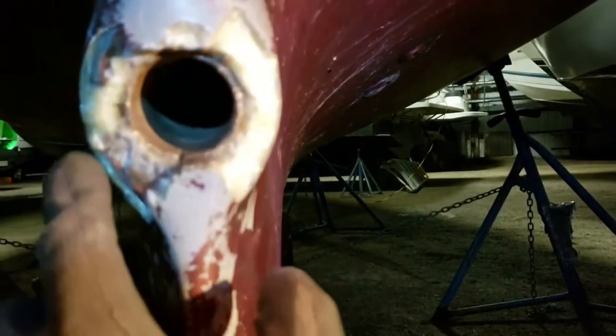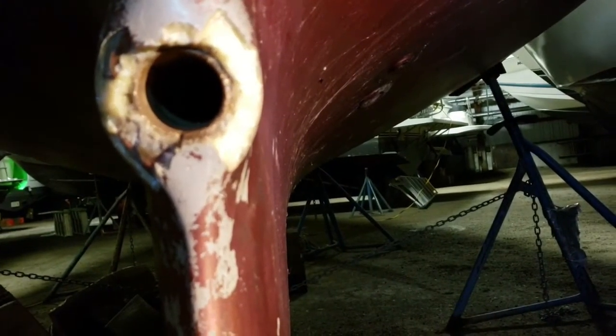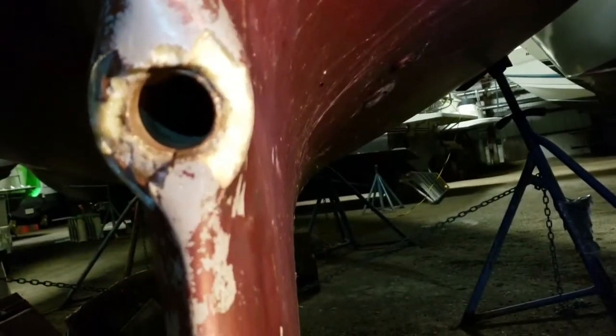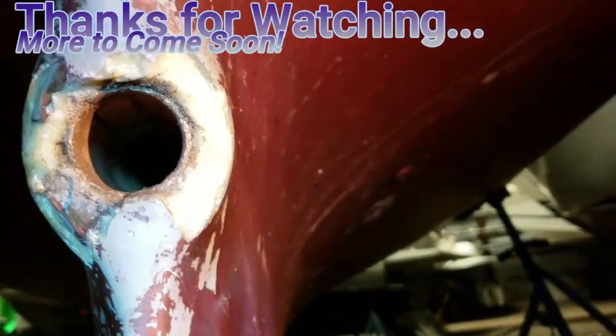It looks like this portion here is all epoxy, which can be easily molded back in. Now there's a saw mark — I was trying to avoid that. Hopefully it doesn't cause too much problem. I think there's one on top, maybe a small one there. So it's time to order a new cutlass bearing, and then just wait for the weather to warm up so I can take care of that. I really hope I didn't damage the end of the stern tube in terms of alignment with the engine. I don't even know if that's something you need to be concerned about on this end — I'll have to check it out.